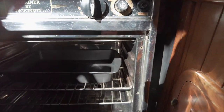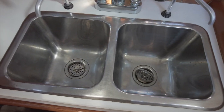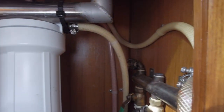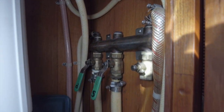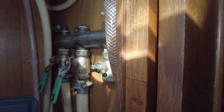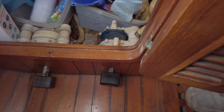And the oven looks really clean. Facing forward is a double well stainless steel sink. Looking at the cabinet below I see a manifold system — I believe this is to switch between the port and starboard water tanks that are under the settees on either side of the salon. There is a combined 60 gallons of water on board. Additionally, there are foot pumps that allow you to pump in raw water for rinsing dishes which helps save on your fresh water supply.